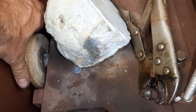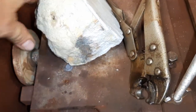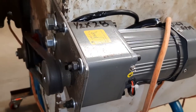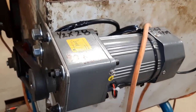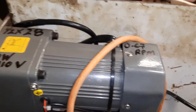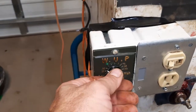Just a piece of plastic off a PVC cap off the end of a piece of pipe — adjust that in and out. For the table feed, I did break down and had to buy a gear motor. I wasn't able to find any surplus center that had a decent duty cycle, but I found this one on eBay — it was $100 with a controller. It's a 90-watt, 110-volt motor; the controller goes zero to 67 RPMs on the front, says zero to 90 but I guess that may be in percentages.